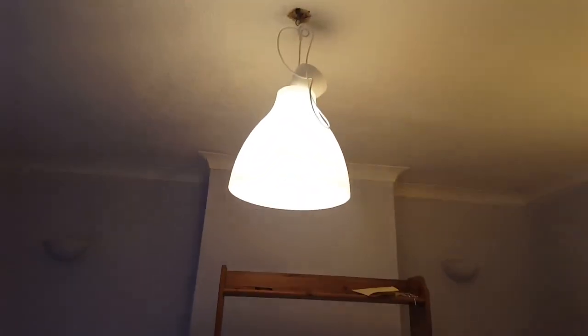I've adjusted the length of the light to about here — I think that's fine, but I can always readjust it. To readjust, whatever length you want, you feed the flex into this part here, loosen it, and make sure you hook it on. That connector block or wago fitting clicks onto the unit — that's about it.